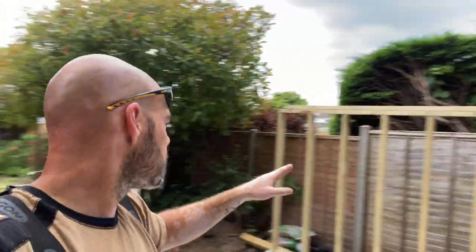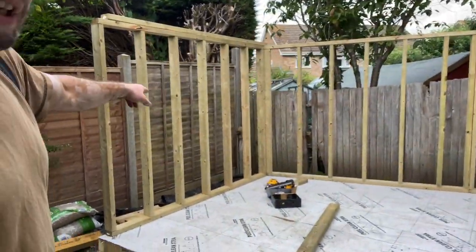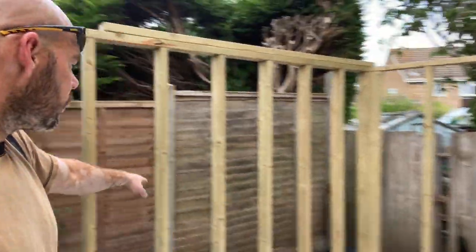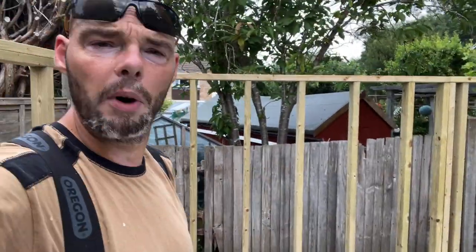So I'm going to use what little wood I've got now just to get them started. But I haven't got many long lengths left. So what I will do instead is I've got all these little bits and pieces, so I'll start knocking up some noggins and whip those through. Generally, there's two ways of doing it. Either you go straight through the center with all of them, boom, boom, boom, boom, boom, all the way around, or you offset stagger. So you put one just offset, offset, offset, offset. So I think I'm going to put them offset.